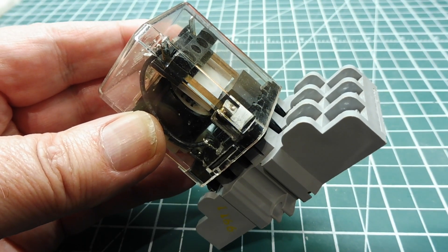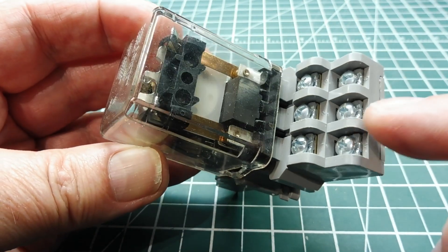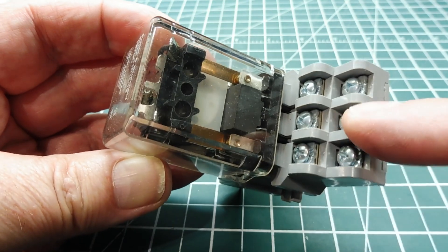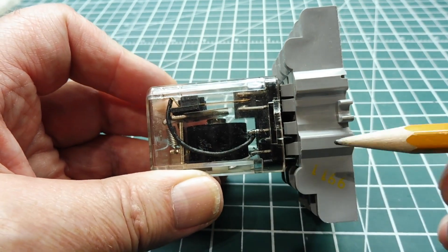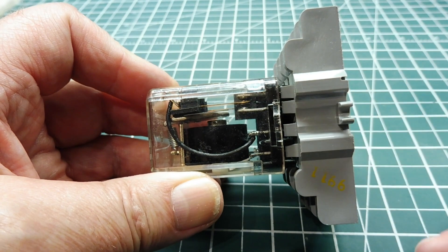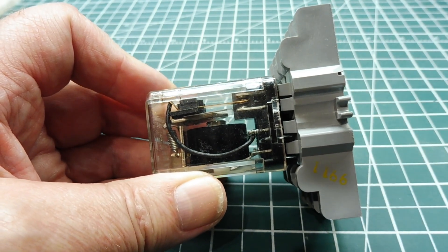For a simple power outage alarm, get yourself a 120-volt relay and a socket and wire up a power cord into the coil of the relay and plug it into an outlet. When plugged in, it energizes the coil and pulls down the contacts to closed. When you get a power failure, the contacts will open and the SCAMP board will detect that and give you a power outage condition.